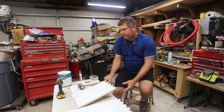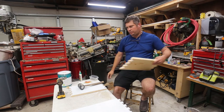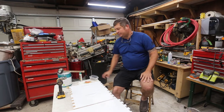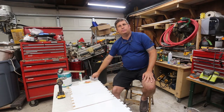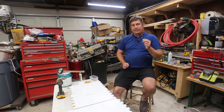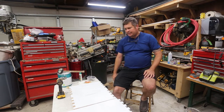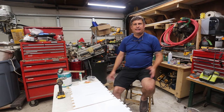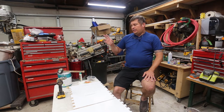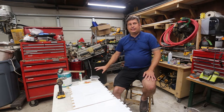What we didn't paint were the ends, and there's a little bit of flash in here that we'll have to deal with, but that's okay. I've also got a hammer to encourage the pieces together gently if I need to, and then I'm using some number eight two-inch screws. These are GRK brand screws. These have a wide head which helps with the hold. I didn't like the nails that Man Lake sent — I thought they were chintzy and I want something a little stronger. I'm probably going to run out of screws by the way.